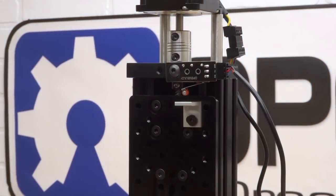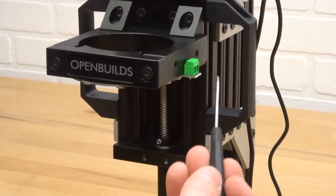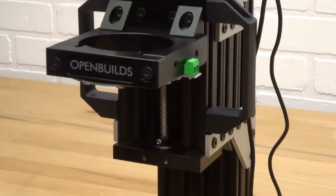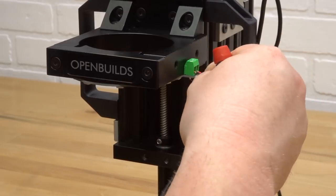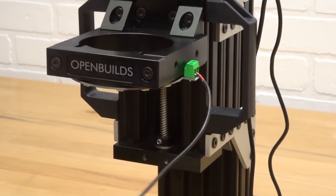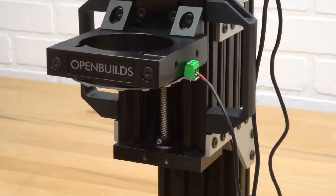Now let's connect the 2-conductor wire to the LED light ring. On the LED light ring you'll see a green connector — loosen the pins on top. Positive is to the right, negative to the left. Connect the 2-conductor wire and fasten into place. Don't concern yourself with the mess; the next step we're going to label all wires and get everything organized.